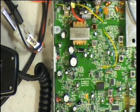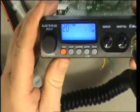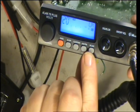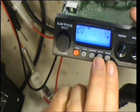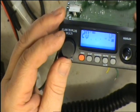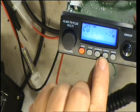The first thing we had to do was to set the channel, and that's done. With the set off, you hold the AM/FM button — that's the second from the right — and the scan button on the right. Hold the two together while switching the radio on, and after it boots up you can then rotate the channel selector switch to what country you're in. We're in the UK, and then that locks into the radio's memory with the AM/FM button.